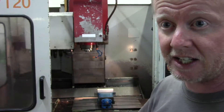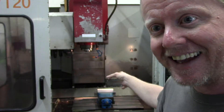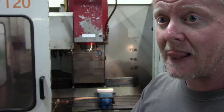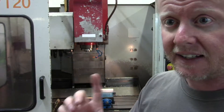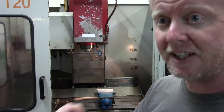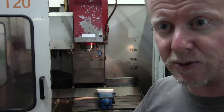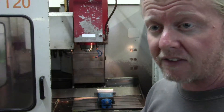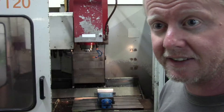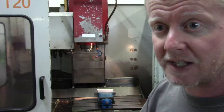The big issue is now the tool holder is in an unknown state. I'm going to go over that at the end of the video if I get this part made — if not, I'll go to the back of the machine and show you. What I did was go to the back and identify which contactor reverses the tool arm, manually reversed it, got the tool out of the spindle, then set up a little MDI exercise to get the tool changer back in the correct state. All of that took about an hour and 30 minutes simply because I don't have full electrical schematics for the tool changer. I've now mapped out and labeled everything inside the machine so I know which contactor does what and which directions they rotate.